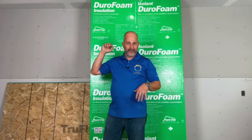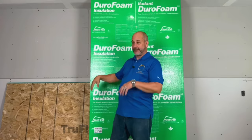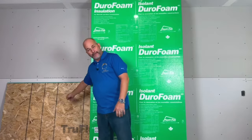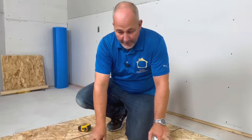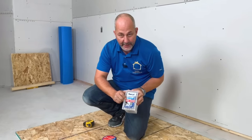But what if you have a new house? This one is brand new — they've already got a vapor barrier underneath the concrete. They've got insulation and soundproofing. This house is elevated with creeks way below, built on sand, no water table anywhere near — about 20 feet above the water table. Grading around the outside is perfect and the foundation wall even has house wrap. Not worried about moisture management. We're going with three-quarter-inch foam for a thermal break and a four-by-eight sheet of 5/8" tongue-and-groove True Floor, tapcon-screwed right into the concrete. Use tuck tape to glue insulated panels together, and tapcon screws — I recommend 2-3/4" long, 3/16" width with a pan head. Don't clean out the dust from the holes; that's part of what helps the screw get a good bond.